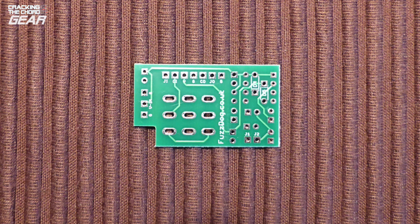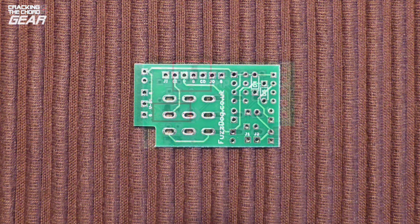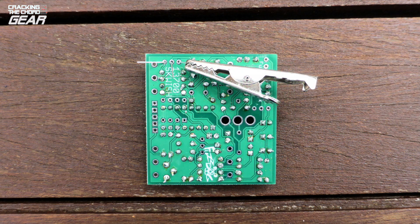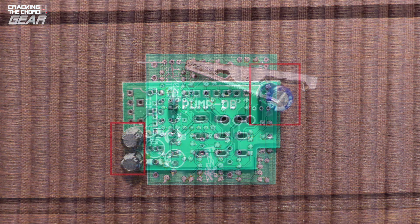Charge pump. The charge pump daughter board has diodes and an integrated circuit as well as capacitors and a current limiting resistor. I decided to install the diodes first. They're installed vertically and again polarity is really important. Fuzzdog's convention is that the negative lead goes through a square pad — the negative lead on a diode is indicated by a stripe. Although I know this, it didn't stop me checking just one more time before getting stuck into soldering. Use your needle nose pliers to bend the leads at right angles. When soldering semiconductors like diodes and transistors it makes sense to use a heat sink on the lead — we're using a crocodile clip here. Having installed the diodes we can then move on to installing the capacitors.